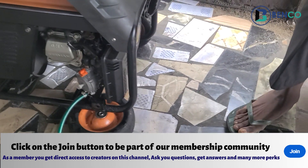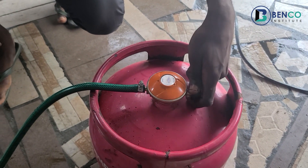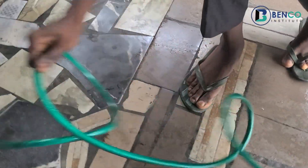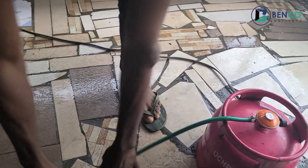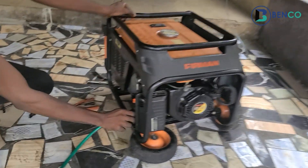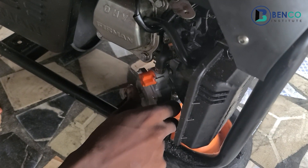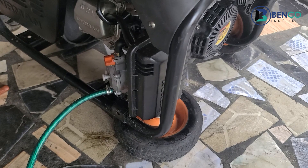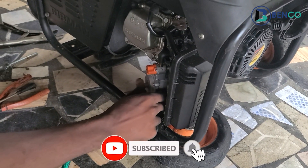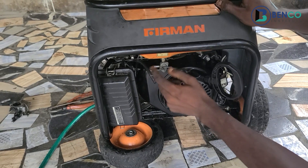Let's put it on and see how easy it is. First, open the gas valve so gas can flow in. Very important — stretch out the hose fully. Then push/purge the carburetor — this is very important as it allows gas to flow from the gas cylinder down to the carburetor and eventually to the engine. After purging, we can start. You can see we've disconnected the fuel port so the generator is not running on petrol.